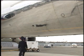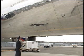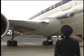In the center of the cargo door, the two pressure relief doors should be closed and flush with the surface. On the lower fuselage, check the condition of the antennas. Check the wing illumination light and the number two right passenger door — the door should be closed and locked if not in use.